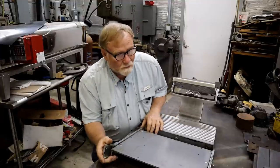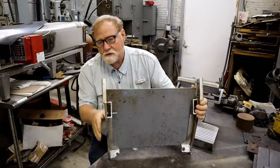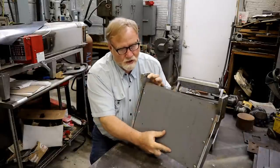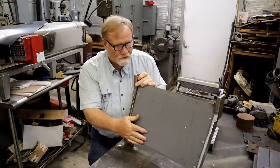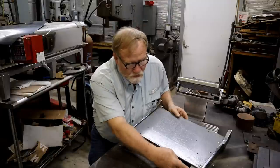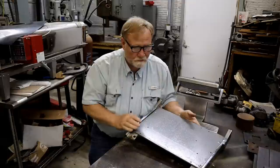You got to be kind of a little detective about these things. Now this part, I went up there and tore it apart. This is a cast iron casting that's been chromed on the outside. It's still rough on the inside where they couldn't get it smooth enough. And this is basically attached to the chair at an angle like here. The back of your calves fit up against this. And this casting comes down and allows this piece to bolt onto it. It's got two places here. This one's busted all to pieces. This one is cracked in several places. And I'll show you in a minute how somebody repaired it.